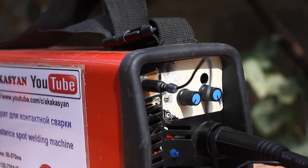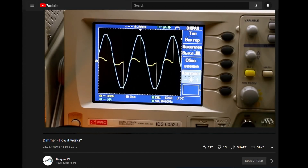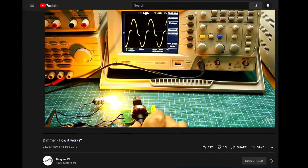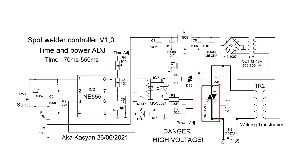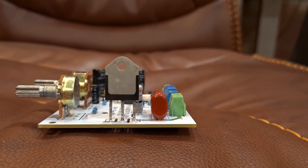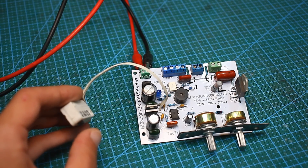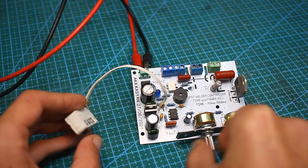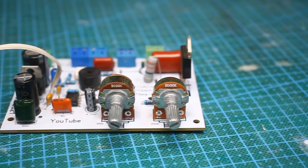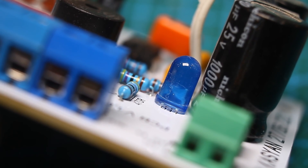Technically, the power can be adjusted from 0 to 100%, but in my case the lower limit is above 0. The adjustment is carried out by the phase pulse method and is based on cutting off parts of the sinusoidal signal — the more the sinusoid is cut off, the less power, and vice versa. The triac operates in a switching mode and, given the short-term operation, heating on it will not be noticeable, but a radiator is still needed. No matter how long you hold the button down or quickly release it, the welding time will remain the same and depend on the position of the variable resistor. The control board has a buzzer and an LED, both of which work only at the time of welding, providing visual and audio feedback of the process.